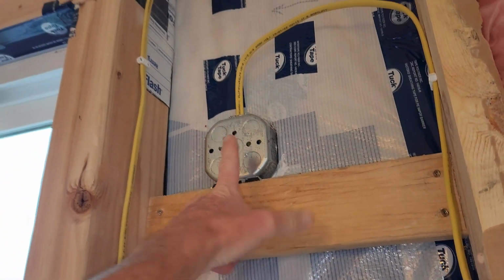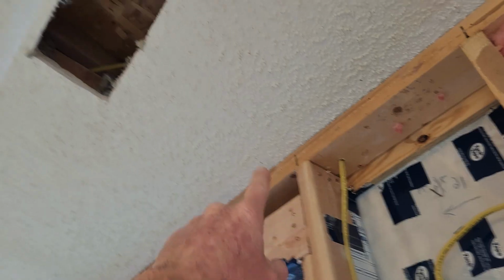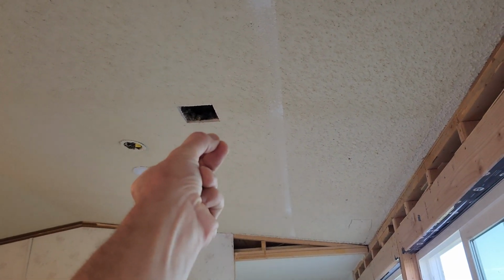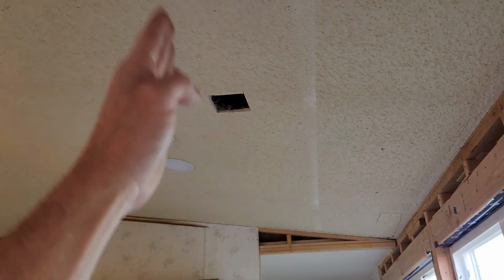This is my porch light right here. So I drilled a hole up through, I'm going to call it the top plate. And this was my first access hole. I tried to fish line it, but because of the cathedral ceiling, the trusses get really tight right through here. More open, obviously, if you're going this way. Tighter because you're crossing over trusses every 2 feet this way.